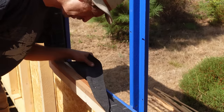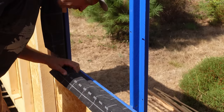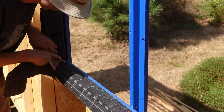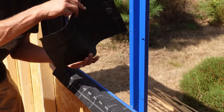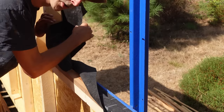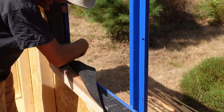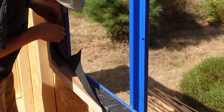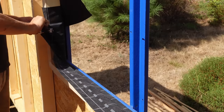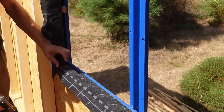Right, foil in. Here, little water repellent edge, so the water cannot run in. But still, there was a bit of a hole here, which would leak, so I'm going to patch it with some leftover. And we'll put it behind the other foil, so the water runs from here to a runoff and doesn't creep in between these two layers. Okay, good.